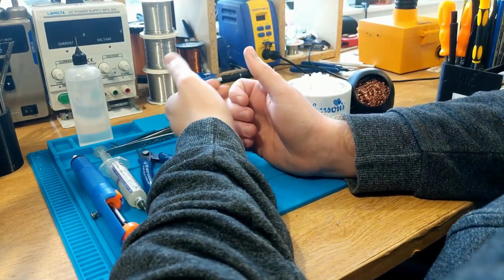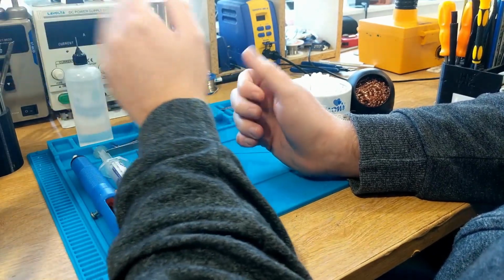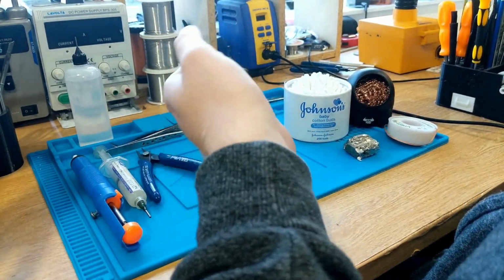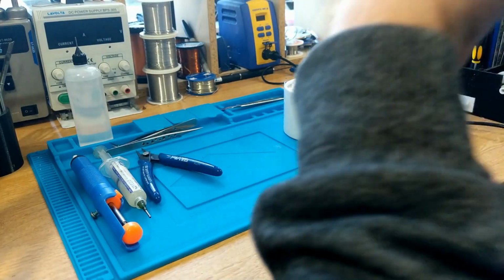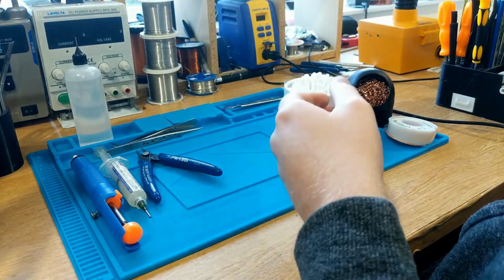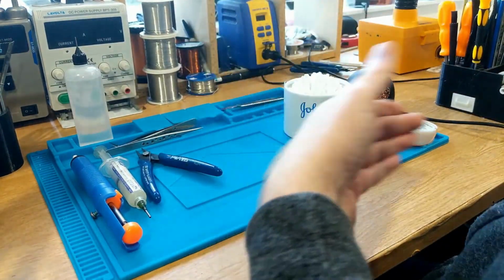And what that would mean is, over time, as it's exposed to the elements, as the plastics degrade, as the device falls apart and disintegrates, not only is that releasing a whole bunch of nasty microplastics and other nastiness that we won't cover, that lead is actually slowly seeping out and contaminating the environment around it. So, you know, you can imagine if you've got several thousand tons of this stuff in one area and then it's raining all the time and so on, you're going to get small amounts of lead leaching into the water table, and that became an environmental concern. And in the year 2000 it was decided globally to phase out leaded solder during manufacture of electronic goods in favor of lead-free solders, of which there are various types. It was the right move, it's still the right move, but unfortunately it is not the most reliable, and there are issues around that in terms of reliability and so on.